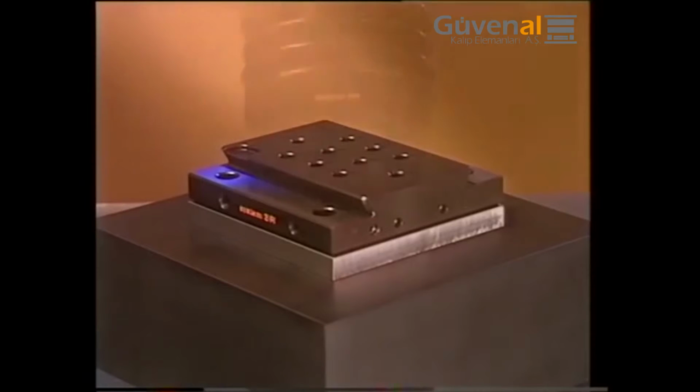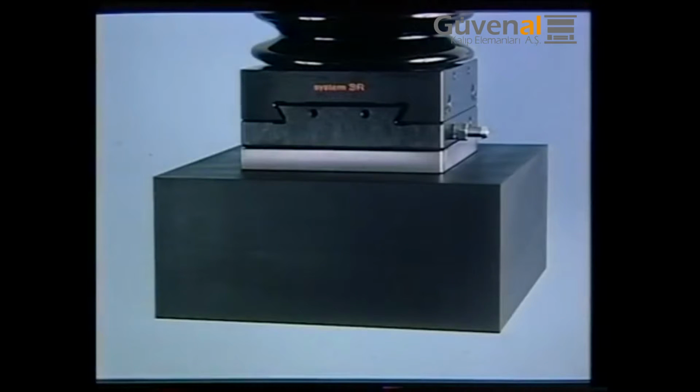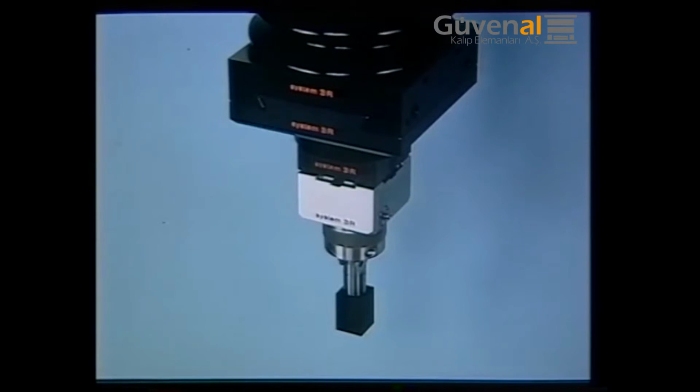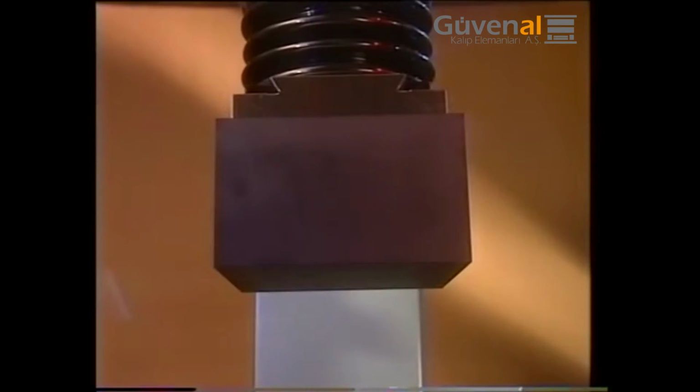Larger electrodes and accessories are mounted in the Maxi system, which is based on the dovetail principle and is known for its rigidity, accuracy and simplicity. With a Maxi chuck on the spindle nose, accessories and electrodes can be changed quickly and simply to cover a wide range of applications. The electrode or accessory is lifted into position with a safe two-handed grip and locked in place.